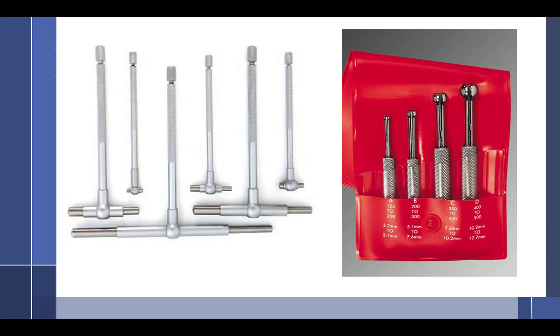And then bring it out real gently, and then when you measure it with the micrometer, I just tend to hold it like this and bring it in and use a little clutch on there, just like you would anything else. But you have to be real careful. Sometimes I don't even trust the clutch on these T-gauges because they're set so tight that it'll start squishing the T-gauge. So I bring it up until it just touches it, just a little peck, like kissing your sister.